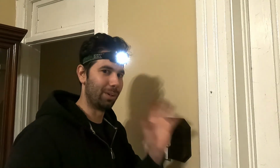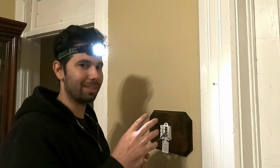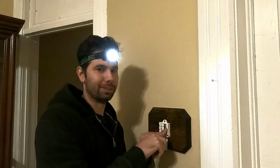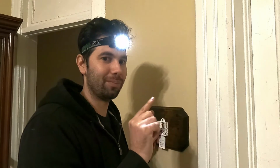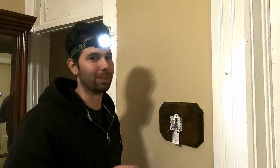So ideally, one would come on, and if it couldn't heat up the house in X amount of time, the second one would come on as like a booster. And I was hoping this thermostat could control it, and it says in the literature for it that it does support W and W2 systems, which would be a 2-stage furnace. But when I was setting it up in the app, when I clicked the W2 wire selected, it was like, nope, doesn't work. It's not compatible with your system. So after a little fiddling and research, I pretty much figured out that that's what was holding me up.